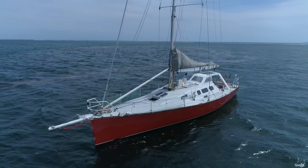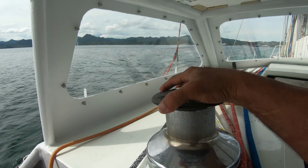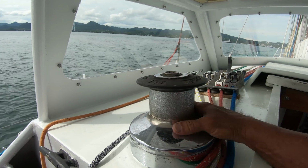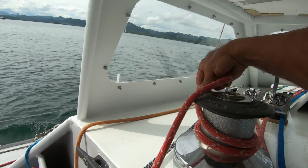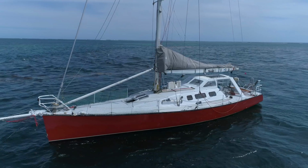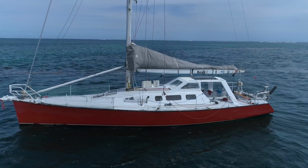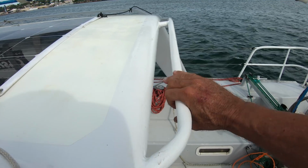The height of the top was important, and the winches on the cabin top pretty much govern the height of the dodger. I have to have easy use, and the rooftop can't get in the way. I wanted to keep the dodger as low as possible for looks, but usability was most important. Got some good strong handholds on each side and the back.